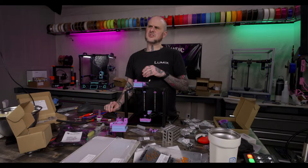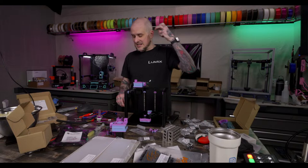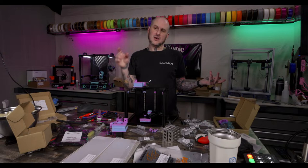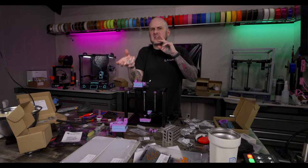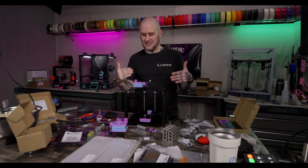Is Dragon High Flow still a good choice for a new Trident? No. Some screens need screen rotate, some need LCD rotate. I tried both of those, and the problem is the screen image rotates fine the way I need, but the buttons don't rotate with it. I think LCD rotate is supposed to move the buttons with it, and for whatever reason, it does not do it on the Klipper screen install that I have. I tried uninstalling and reinstalling multiple times. It didn't fix it. I'm going to revisit it soon because that machine needs an overhaul anyway.